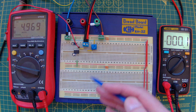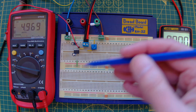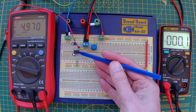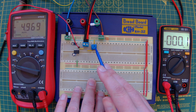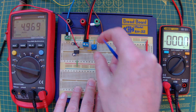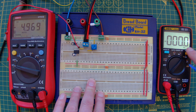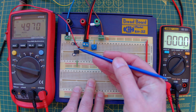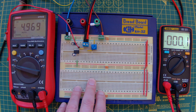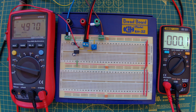One key thing to bear in mind is you cannot draw a lot of current from it. If you need more than about 10 milliamps then this is probably not the right solution, but for a lot of op amp installations it's been perfectly fine. I've added a potentiometer to adjust the load on the output, along with a meter in milliamps range in series. Currently at virtually no load, I'm reading minus 4.9 volts.